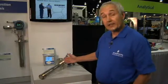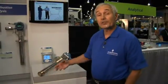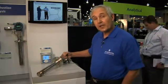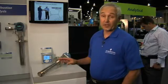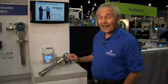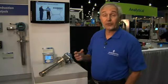These probes are manufactured in lengths anywhere from 18 inches to 18 feet, and we also have a variable insertion capability so that you can place the sensor in exactly the right spot of the furnace to get the information you need. This analyzer has an accuracy of five hundredths of one percent oxygen, so it's a very accurate instrument, used to maintain optimum efficiency and also produce the least amount of NOx pollution gases and CO2 greenhouse gases.